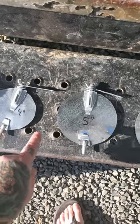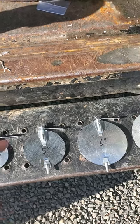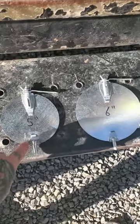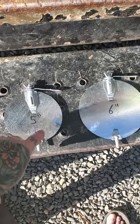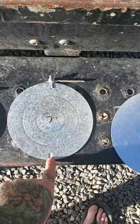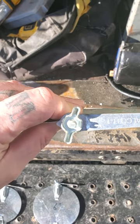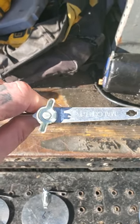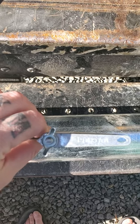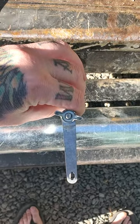Notice this one doesn't have the double-sided stud that these ones do. The ones with the studs on both sides are made for what's called a long collar, typically in an attic when you hook flexible air duct over it — it has a hole on both sides of the duct to hold it on an axle. If you can only get these kind, you can cut this bottom piece off with tin snips. It's okay to have a little gap; it's okay for a little air to bleed through. But if you can find the ones that don't have anything on the bottom, those are the ones you want. If you look at how this damper works, it's just a wing nut that holds this handle down. The line indicates the position of the damper — so if it's parallel with the pipe it's 100% open; turn your handle perpendicular to the pipe and it's 100% closed.